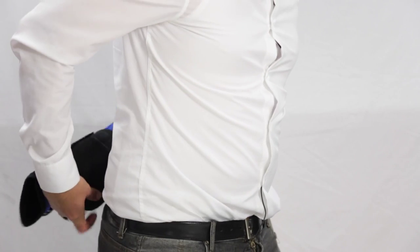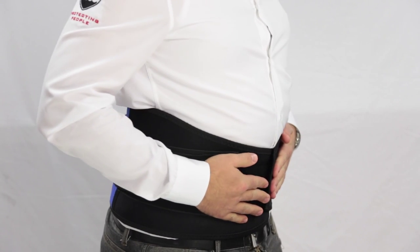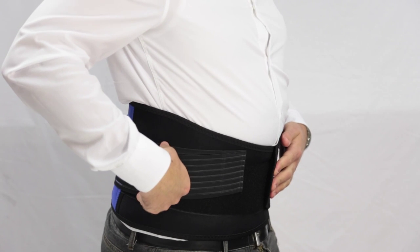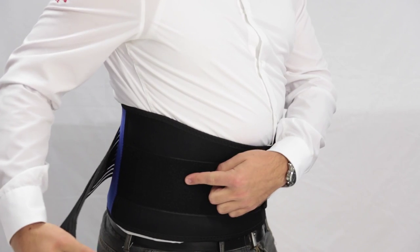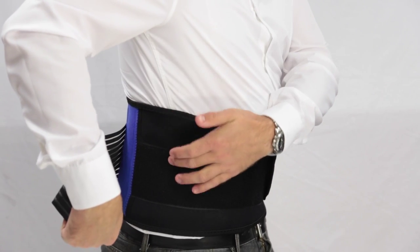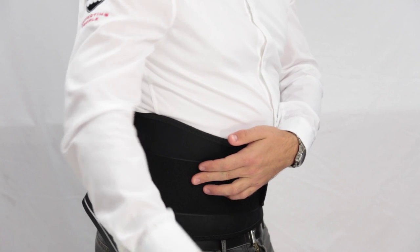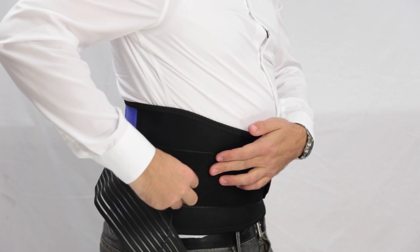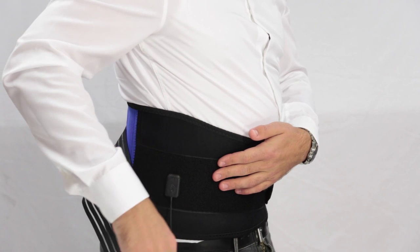The only validated way to do this is by means of a kidney belt where you place an accelerometer. The kidney belt should be worn as close to the body as possible. It is important that it's tightened very snugly around the waist and that it goes down over the edge of the pelvis. The body transducer should be placed inside the kidney belt on the side of the body, straight below your armpit, right above the upper edge of the pelvis. It is fastened to the kidney belt by velcro and will sit very still and stay well fixed relative to the body.